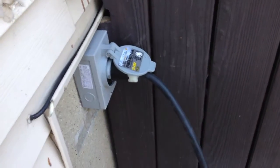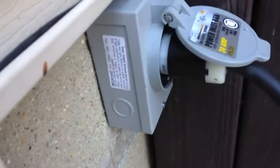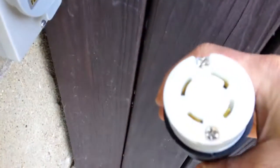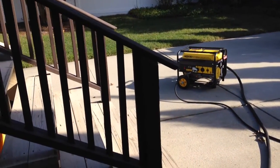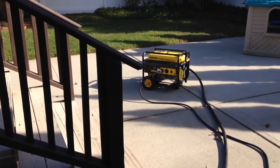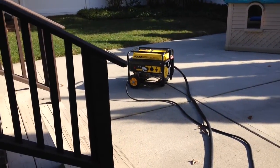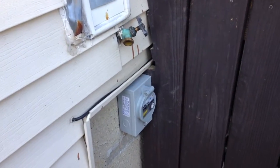That whole assembly was about $50 from Lowe's. It's just nicer to buy the whole thing rather than make your own box — a lot easier. This cord actually cost me about $100 total: the cord itself was $50, the 240-volt receptacle was about $30, and the 110 plug on the generator side was about $20. It's well worth it — it's meant to be outdoors and it's a lot more convenient than trying to back-tap into your panel.